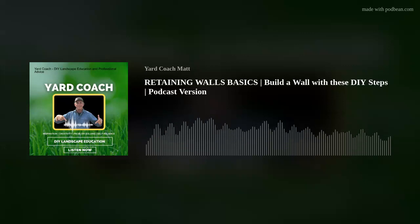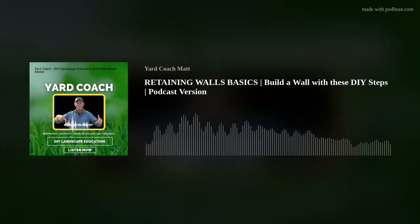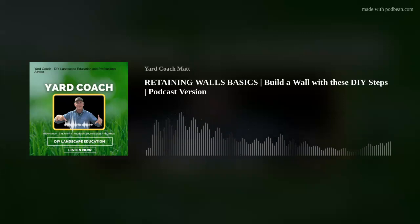And most of the time you're going to have to do a little bit of either vibratory settling in that vertical pour or coming along and tapping both sides of that form throughout the curing process for about the first 2 hours. And then when you start to finish it and you know that you have a settled wall, it may not be cured, but it's settled, then most likely on the front side, you're going to take that front plywood off and do a finish of whatever you want to do.